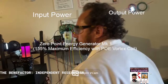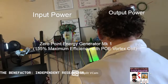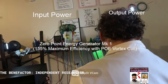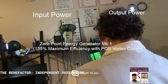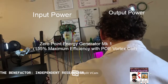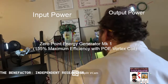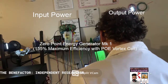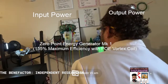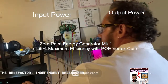We are all set up. We got the coil flipped, hooked up, and ready to rock. Square wave is a DC pulse. So you're saying I should switch it to sine wave. That's possible too. That's another variable I did not consider as well. The waveform. What waveform are we on? I was on square wave. We might need to do sine wave. So that's something to also consider.